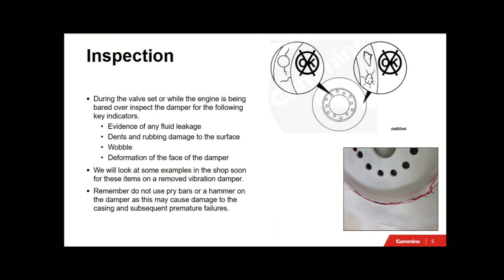It's only a narrow gap between that outer casing and that inner solid steel ring. Here is an example of a failure that was identified through fluid leakage loss during a tune-up event. Once it was removed and inspected, it was identified to have quite a pronounced swelling and subsequent cracking from that stress-induced failure. When we spoke to the operator, he did notice a notable rattling noise typically between 1,400 and 1,700 RPM, effectively through the bulk of the torque and the transition into the power range.